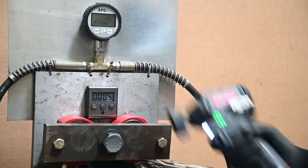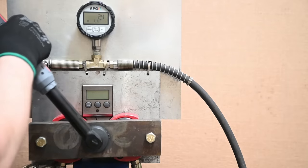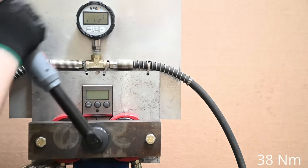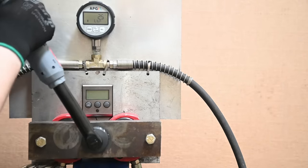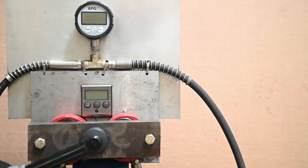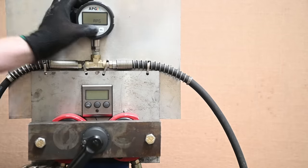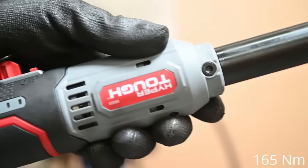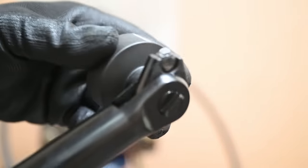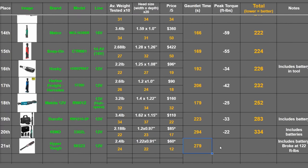The ratchet, on the other hand, has a very accurate torque rating. With the usual nudge it makes it to 33 foot-pounds of the 33.3 advertised with a 4 amp hour battery, or 28 foot-pounds with the included battery — not bad. When used by hand, it lets go at around 122 foot-pounds, joining two other ratchets that died on the run up to 250 foot-pounds, taking the lowest figure — though only by a couple notches from the Craftsman.